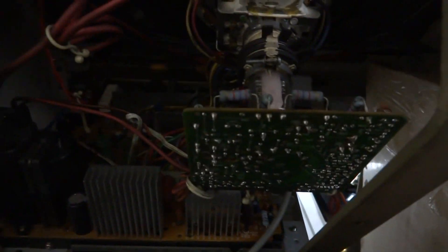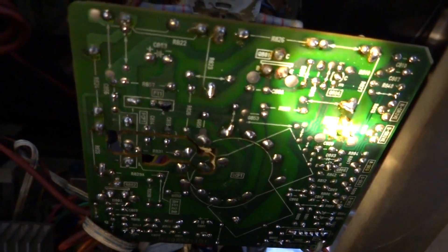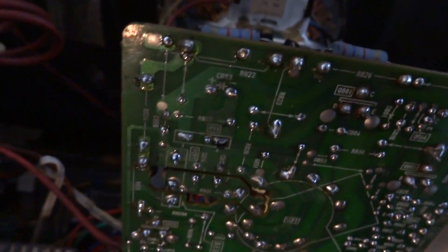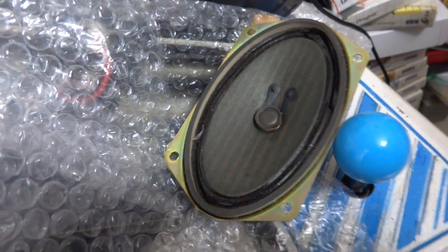So far I've gone around the bottom of the board and also gone around every single solder point on the back of the neckboard — there aren't that many points so it's not too bad. It's really easy to get at all of them, so I just went around each one to tin them all up and make sure they have good contact. Around the cap a lot of these break loose which causes problems, but going around all those should help improve this or at least keep it stable. I've got the anode cap back on and everything is ready to go. Next I have to replace the speaker.